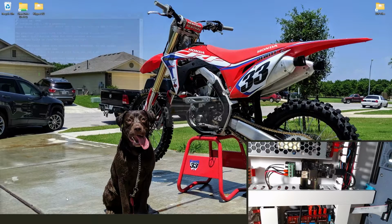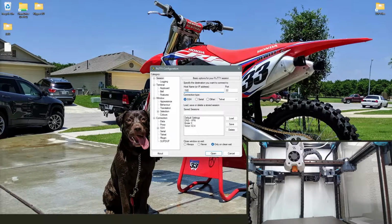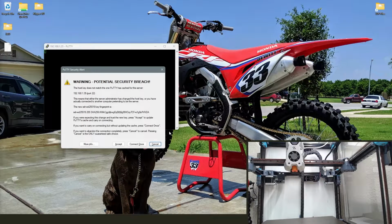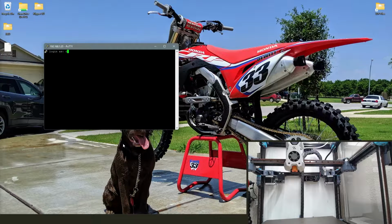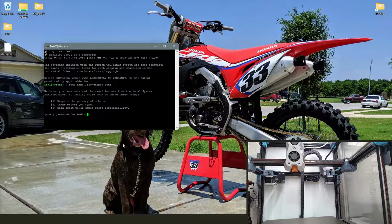All right, and then at this point I did go back and completely wipe and start with a fresh install on the Pi. So real quick here, I am going to set a static IP. I have a Netgear router, and if I assign an IP on my router, it hates it. It can't figure it out. Everything gets out of whack. I don't know what's going on with it. So I have the DHCP set to only assign from 20 to about 180, and then I can come in here and assign static addresses like .196, which is what I'm going to do for this.